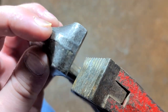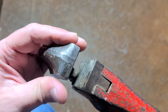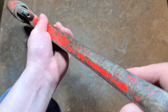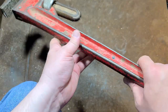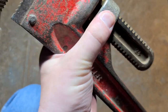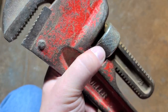The thin little line indicates metal being put in after the dies were closed. Something that's forged will have a really thick area of flashing — where the metal is put in and then the two dies are smashed on top, causing flashing to get squished out between the dies. This one's certainly been hammered on a bit, and it's taken the beating well. You can tell how a pipe wrench has been used just by seeing how rounded the jaws are. I noticed the jaws were in good condition here, so I decided to go for it.